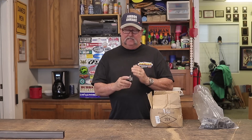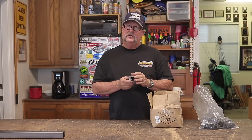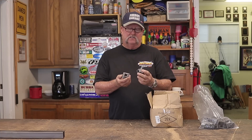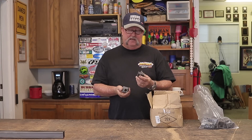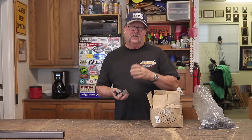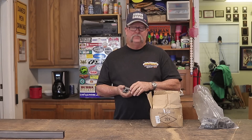However, the collars go all the way around, and for the flush picket setup I need to cut these collars in half — you'll only see the front side. Not a problem — went over to the band saw, started cutting, got two or three of them cut pretty good, but then a couple of them just wouldn't cut at all. Turns out this collar material is a mix of all different things: some cast iron, some regular metal, and some sort of hardened metal that wouldn't cut at all. I changed the blade on the band saw — that did nothing. So I had to abandon that approach.